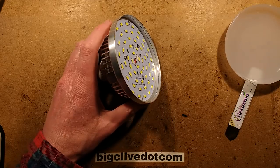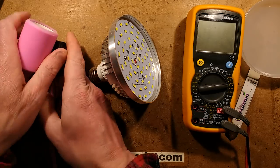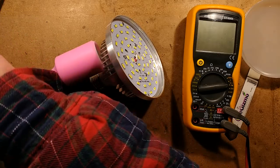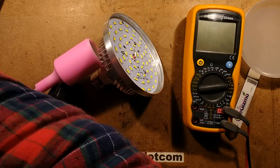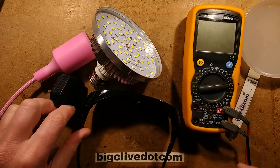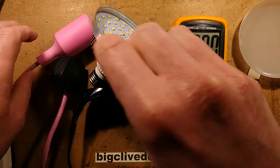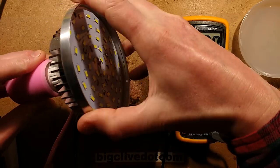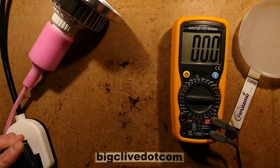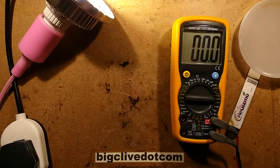Let's bring the meter back up and get that little bit of stuff off it. Let's bring the socket back up. This is where I really should have my dark glasses — I don't have them in the vicinity. Staring directly into very bright light bulbs gets very visually fatiguing after a while. Oh, there they are — I've found my brazing shades. So let's set this to about 200 volts range, and I'll screw the lamp into the holder, put on my shades, get that lamp lit up, and try and fumble my way into the connections to see what voltage we get.